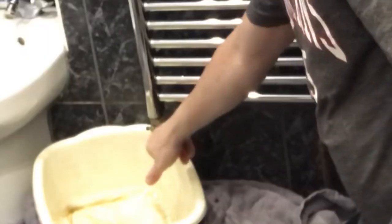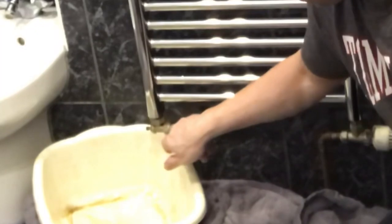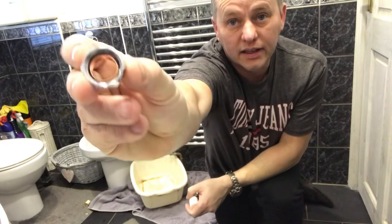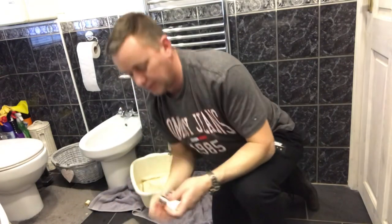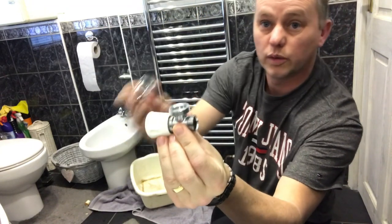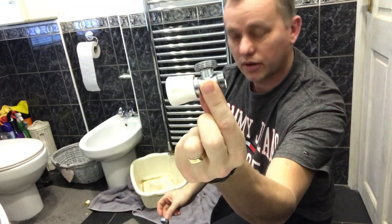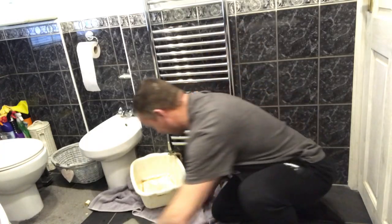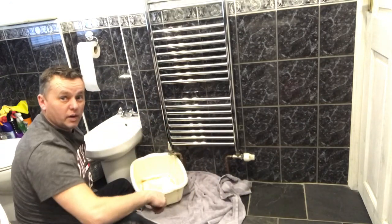We should be all right now — we've taken the pressure out of the system and it's all drained down. We're going to take this union off here, but we're leaving the nut because the olive is still on this pipe. Literally all we're going to do is replace the guts of this — just this part. The section with the olive in it we won't use as there's already one on there. It's going to be a quick undo, bang that straight back on again — job's a good'un. In theory.